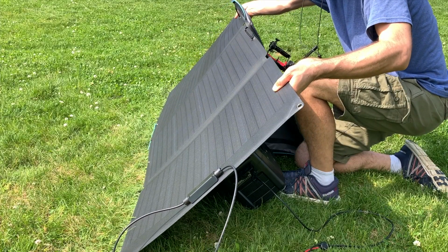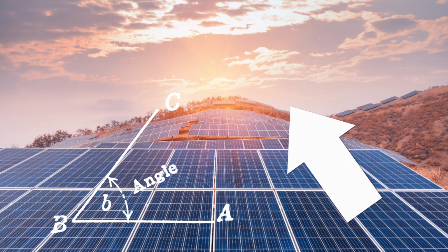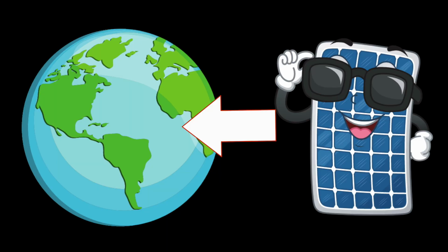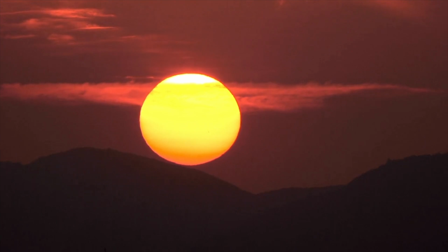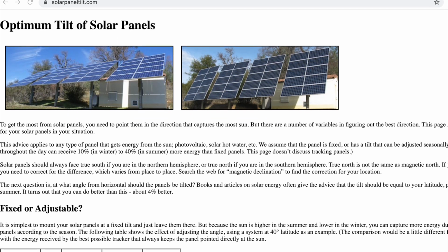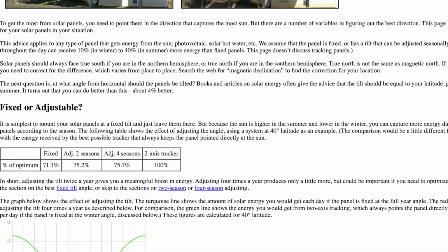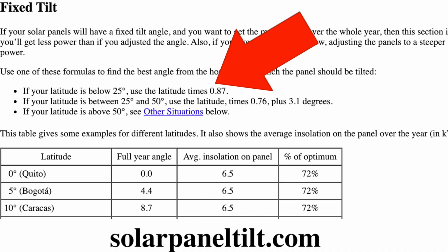So you can move portable panels, but what angle and direction should you choose for a fixed location? Well, for direction, you ideally want to point your panels towards the equator. This will give you the maximum sun hours. For angle or tilt of the panels, you want to choose the best average for your location. I have a resource listed in the description you can check out, and there's a formula on there.